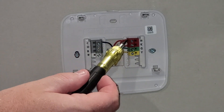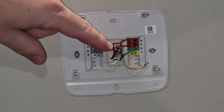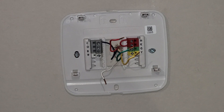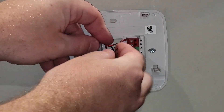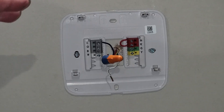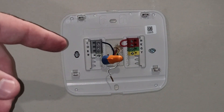Just take a little screwdriver, undo all these screws, and this is what you're left with: your R, G, Y, and W. In this demonstration I only want to run it in cool, so I'm going to take my R, my G, and my Y and put them together. I'm not going to worry about making it too perfect only because it's very temporary — do not leave this on forever. That right there will turn on your cool system until you physically take the wire nut off or you turn the power off to the indoor unit.